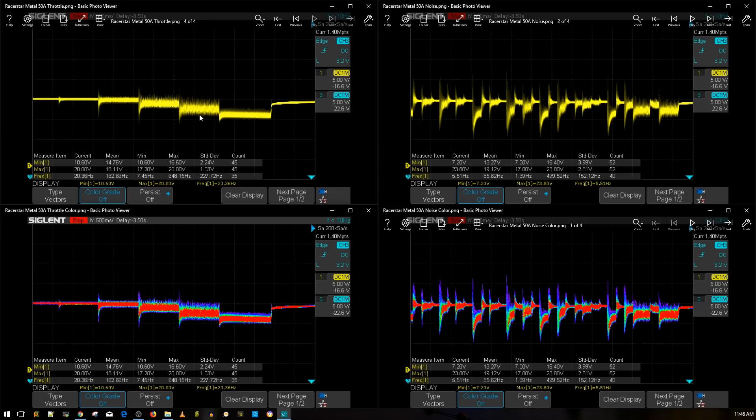The possibility of mid-throttle oscillations due to electrical noise is very minimal on this — it's as minimal as a DaL RC. On the right side we have the simulated aggressive flight maneuvers: quick rolls, quick throttle changes back and forth, testing how well the ESC handles back-EMF voltage re-entering the system. We're looking at whether there are large voltage spikes or whether it's soaking them up, and whether the voltage amplitude stays consistent.